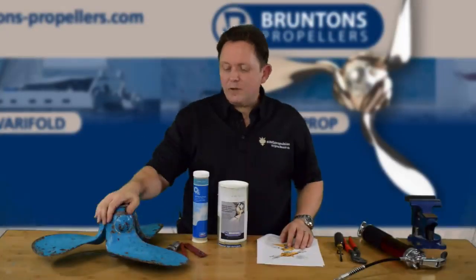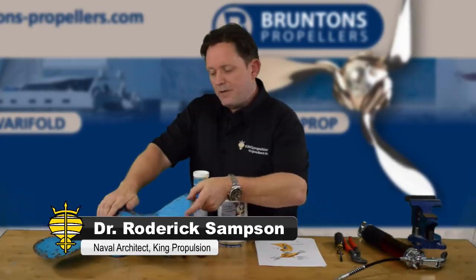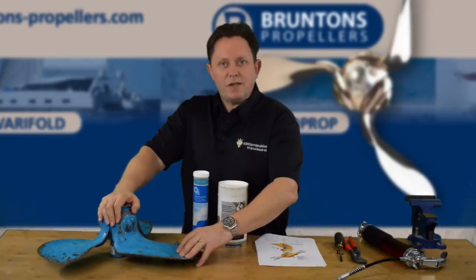So you've just hauled out and you notice you're up to about 800 to 1000 engine hours and one of your blades is a bit grindy. It's not as freely moving as the others. It's probably time that the bearings were swapped out for a fresh set.